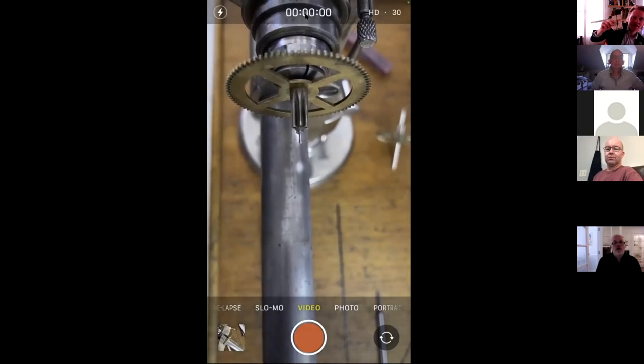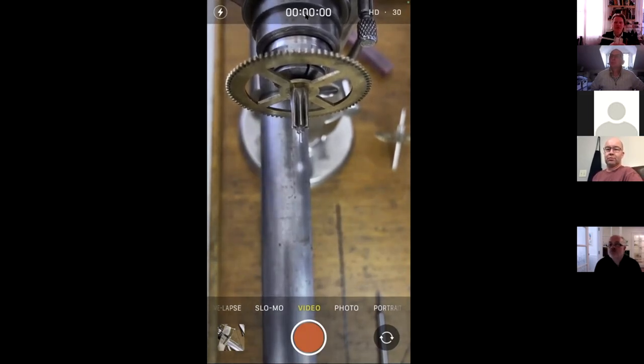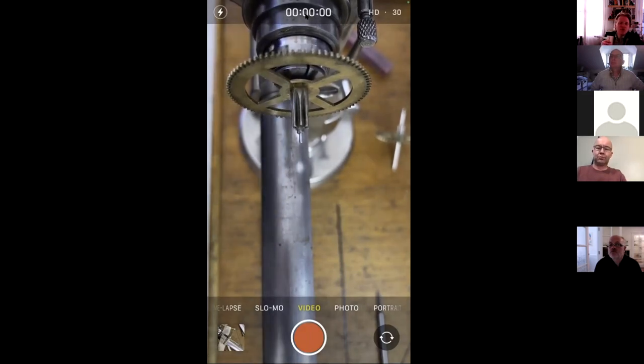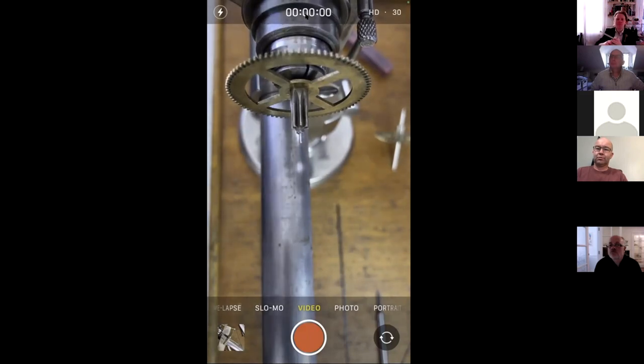Coffee, the answer is how much are these clamps? I was using these clamps for the Christmas clock, the so-called terrible clock during the week, and I put them on Facebook. They're a cam clamp, with cork faces. The beauty of these, unlike G cramps or sash cramps, is they're not that heavy. I think these are favoured by musical instrument makers. And if you're working on something like a tall case clock, a 19th century thing, the cases are often so flimsy you don't want a lot of metal on there.